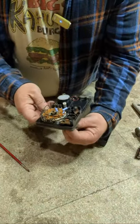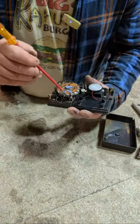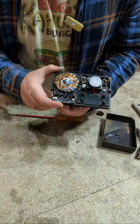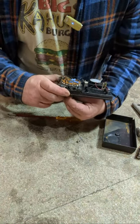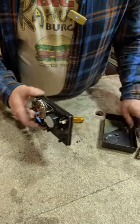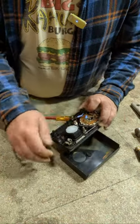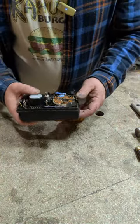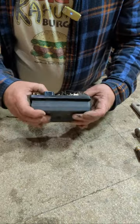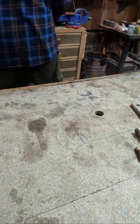I've got a little potentiometer here. That's an interesting potentiometer, because if you look here, you've got this resistance bar, and it's literally just touching it; depending on what position it's at, it changes the resistance. That's pretty clever. I'll leave that open to dry. It's obviously got wet. Put that screw in there. Does it have a fuse in it? There are no fuses in it. I think I'll put some contact cleaner on there later and see if I get it working. Might work, might not.